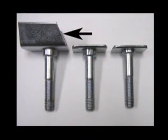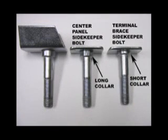There are three side keeper bolts. The winged keeper goes on the sled panel because it sustains the highest impact velocity and has more surface area. The taper on one side matches the sled panel taper. All of the center panels have a collar that is designed to pin the side panels to the mobile frames. However, the side keeper that goes in the last terminal brace has a shorter collar because it does not pin a panel to the mobile frame.